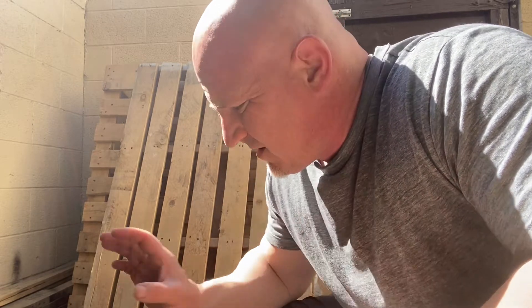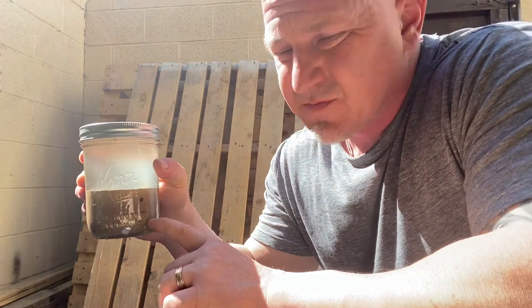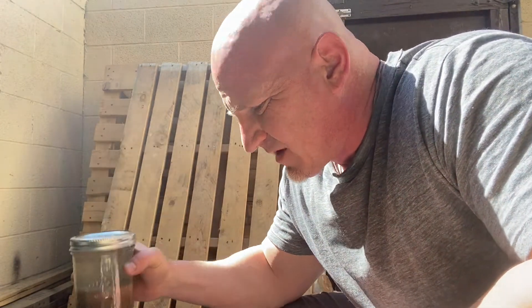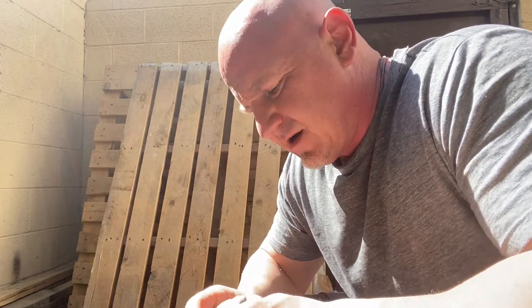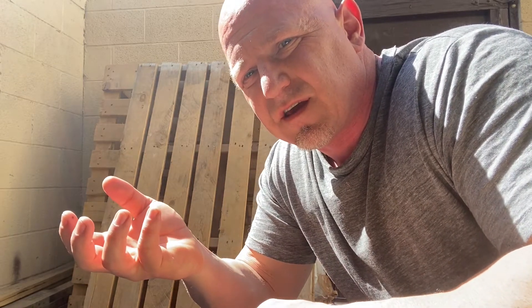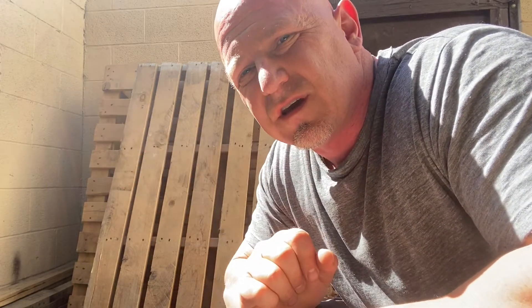Today I'm going to test the soil physically. I'm going to drain the water out of this jar where everything has been separated, mix it up very good, and see if it holds form and shape. First I will do a mud ball, and second I will roll a little snake and see if it actually holds — that will show me if the clay content is enough to use for a cob structure or not.